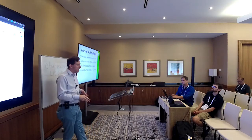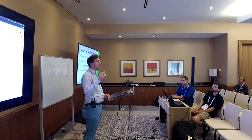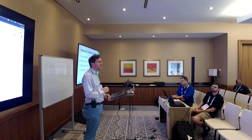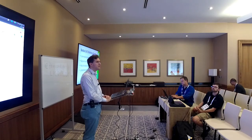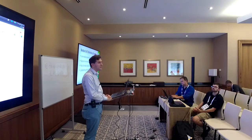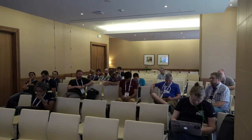Then the second part is that I have taken the decision for now to go with the soft MAC approach for the very simple reason that we do not have the LoRaWAN layer implemented completely enough to actually use that. So that provides us one way to actually send out data today. And in the end, it gives you more control. Yes, it might be better for some specific products to have a hard MAC in the end, which is completely fine. But from a software perspective, it's good to have a soft MAC around that you can actually debug and find out what's going on, what the problems are.